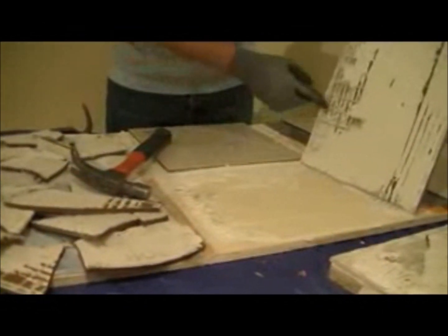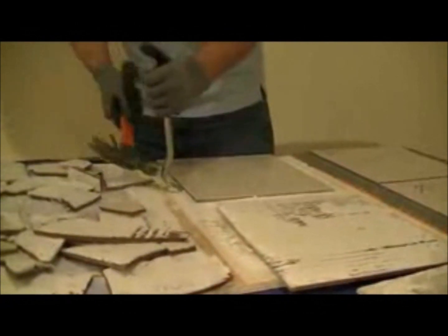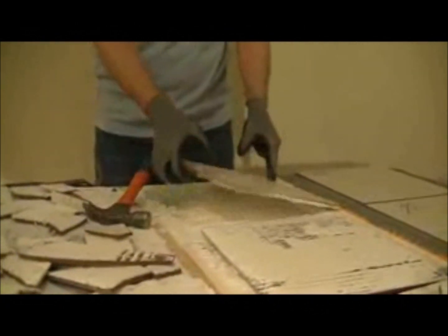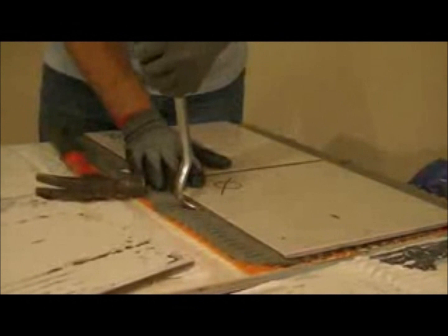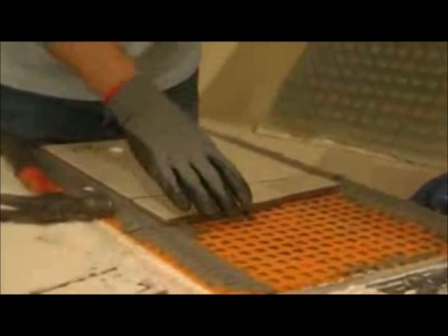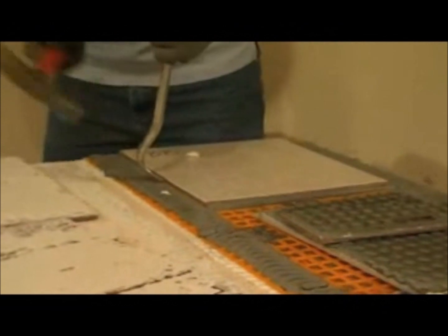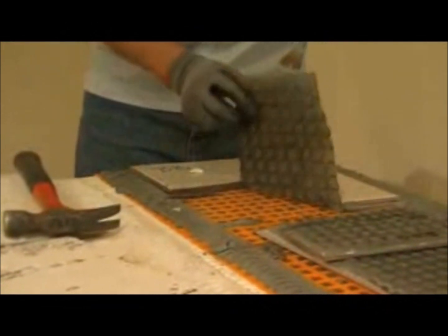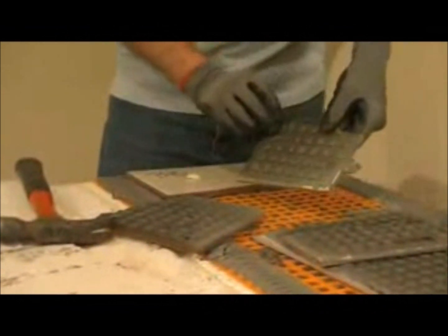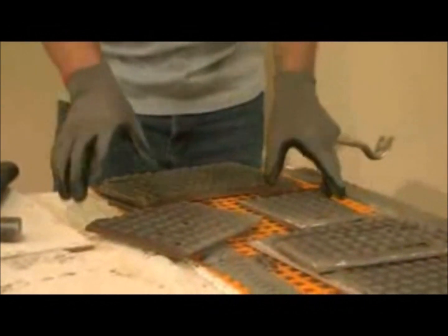Moving to the plywood — voids underneath it. When we removed the second tile, you see that the thinset didn't even stick to the plywood. Okay, now we moved on to the DITRA. We started with the tile that was not back buttered — this one surprised me. I did not expect that the thinset would be drawn out of the waffle backing on that tile. Moving to the one that was back buttered, the only difference was that it took much more effort to pull up that tile. Because the DITRA is mechanically bonded, apparently that's why the thinset comes up with the tile.